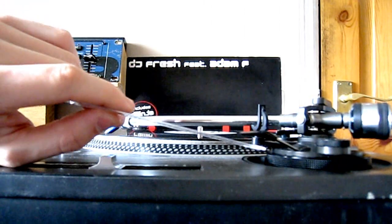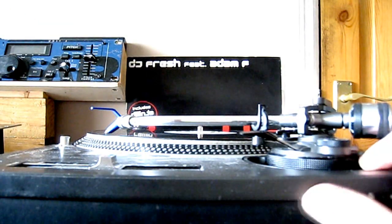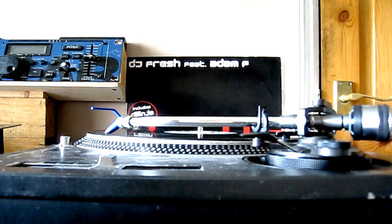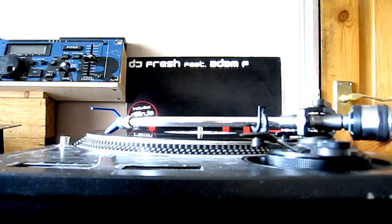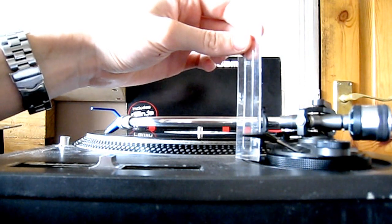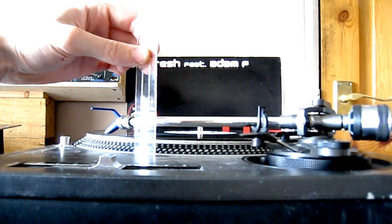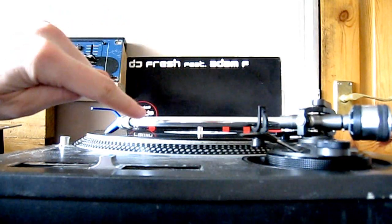On the top here you'll have some numbers on this bit that you rotate to take it up and down. At the moment that's on 2. So if I take this down until it's at 1, like that, that means it's now going to take that down by 1 millimetre, and we should be equal both sides. So that's about 23 and a half there, and that's just over 23 now. So we're about a quarter of a millimetre out by this point.